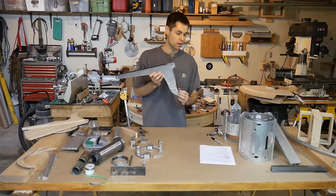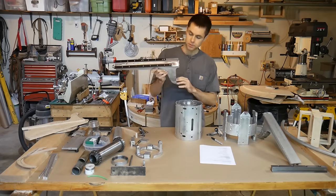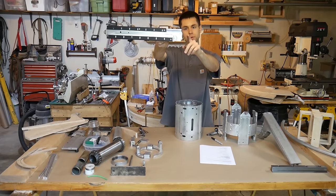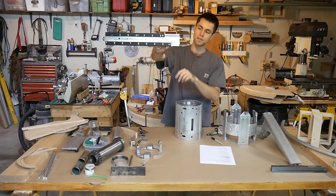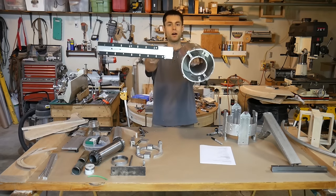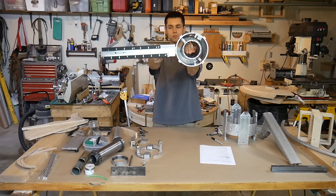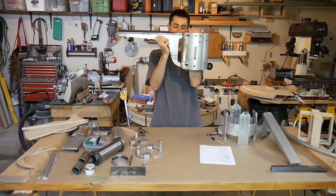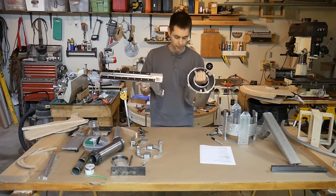When it comes to mounting these arms on the hub, what I did was to cut a concave shape into these pieces and then weld those from the inside so that this can match up to the hub and fit nicely on the radius. Then it can be rotated to align it, or shimmed a little bit on the bottom to control the elevation at the end.